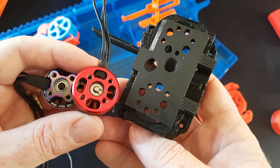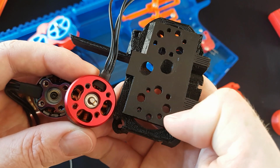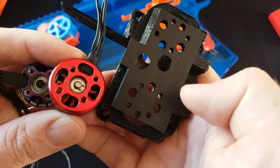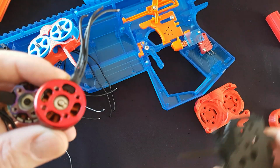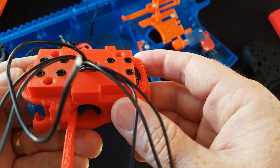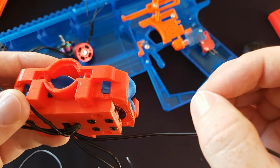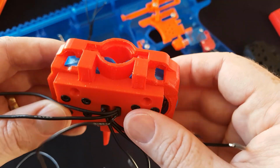That is another change we've made. We were using the screws that came with this to retain it, which just meant the thickness of the M3 nut was helping on a vertical push, and well, that's not vertical, that's horizontal, and vertical just the head of it. With the R6, I'm not going to use the existing screws. I've gone to countersunk M3s, which help with getting pulled out, depending on which direction we're referring to. So that's pretty cool.